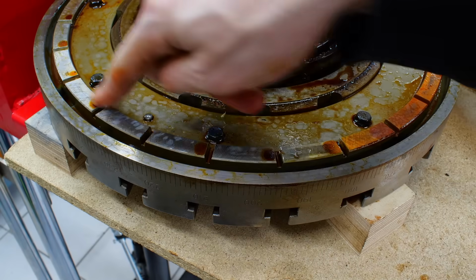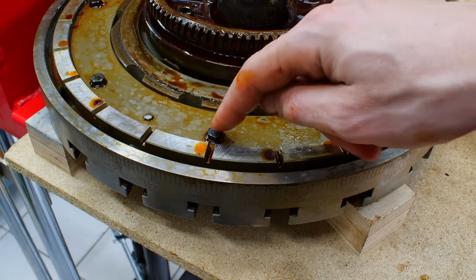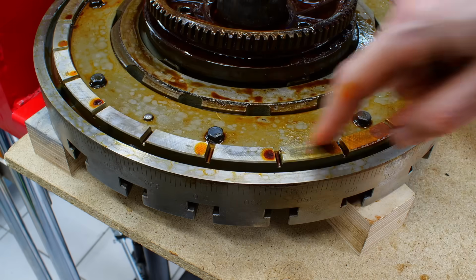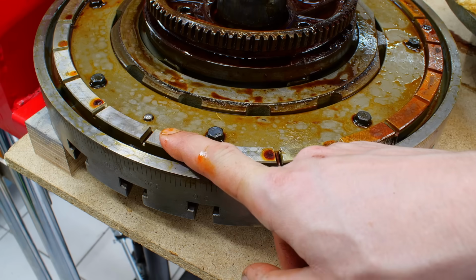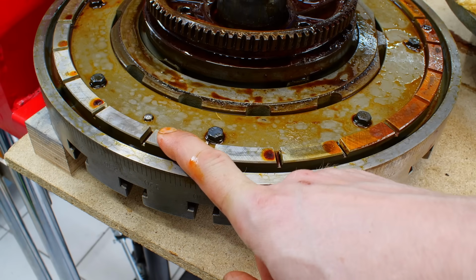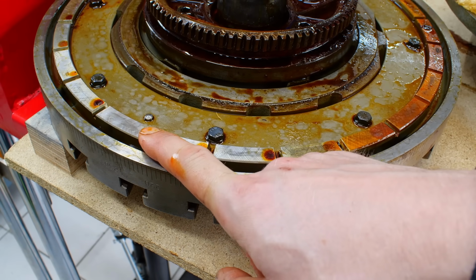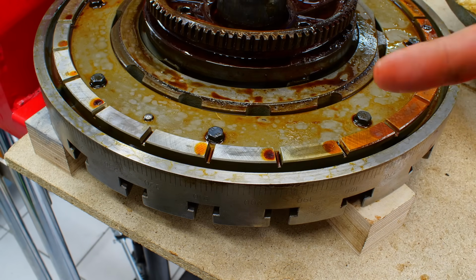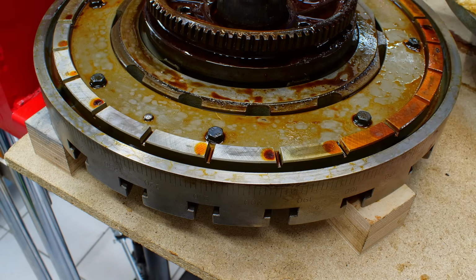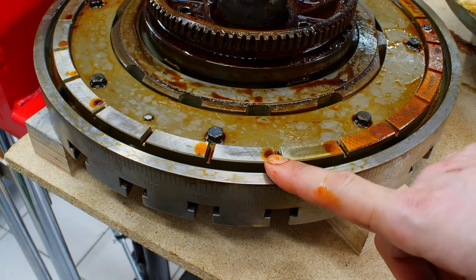Out here you can see this ring is bolted on and pinned in place. This is the direct indexing with 24 positions, and this direct indexing ring should also be accurate to 90 arc seconds, which is not terrible. It's way less good, yeah. Great English, Mr. Stefan. Way less good than the Moore indexer, of course, Moore rotary table.